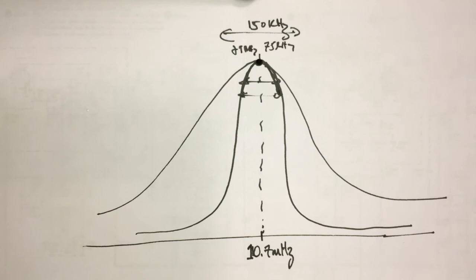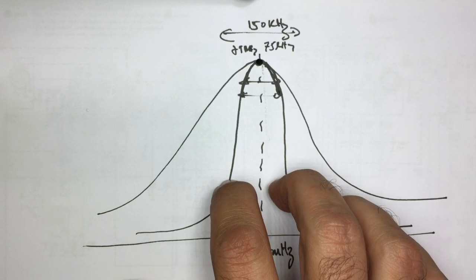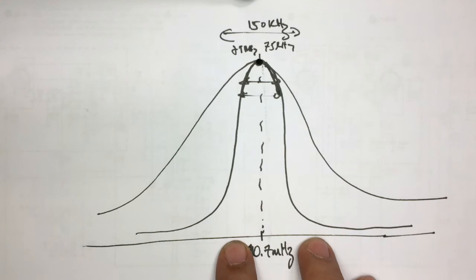And the way to tune it is to actually put a voltmeter across that capacitor, that electrolytic I mentioned, and measure the voltage, the negative voltage, and get it to peak at the 10.7 megahertz. Now, again, this is why they always say it's better to do the FM alignment visually with a sweep generator, so you can see what shape you're actually aligning to.